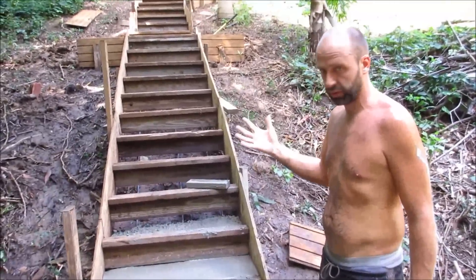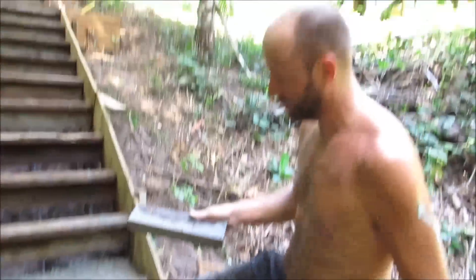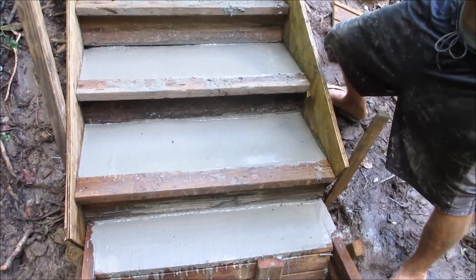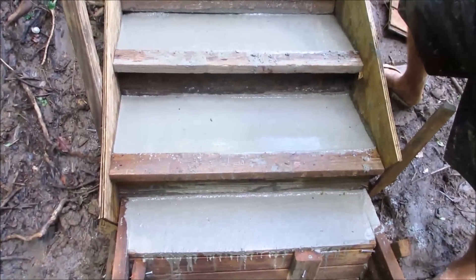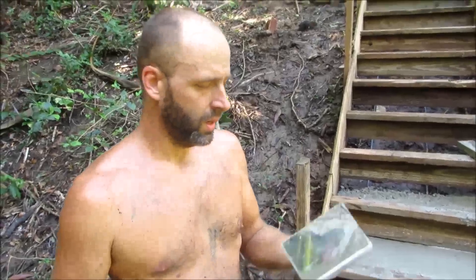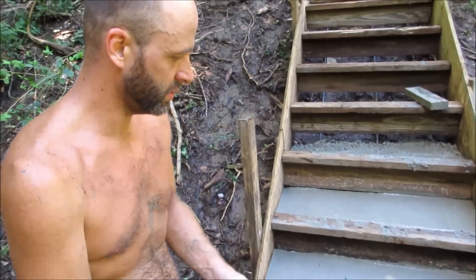Once you start pouring the concrete and filling the molds, every step backfills the next. You can work it with a two-by-four on top to get it basically flat and work some of the rocks down. Once the rocks are settled in, you use a finishing trowel to get it smooth. After it's smooth, you want to run over it with a broom to give it an anti-skid surface so that you don't slip. For the front of the steps you can use an edging trowel — it has a curve — and you run it right along the front edge of the step to give it a nice rounded edge so that the cement doesn't flake off.